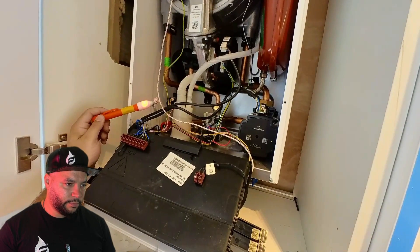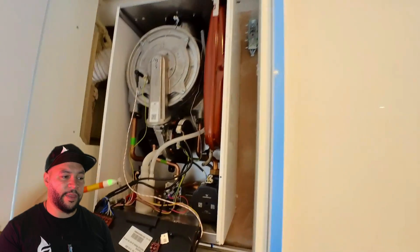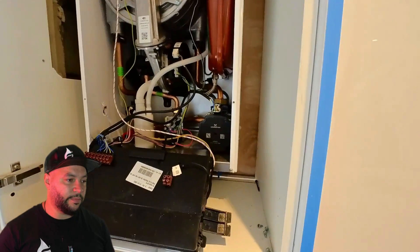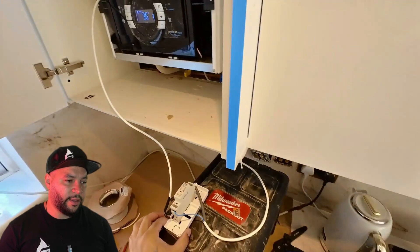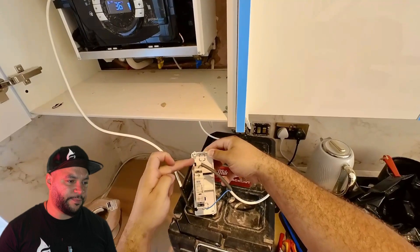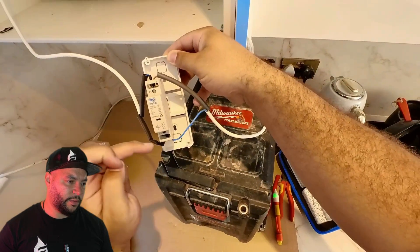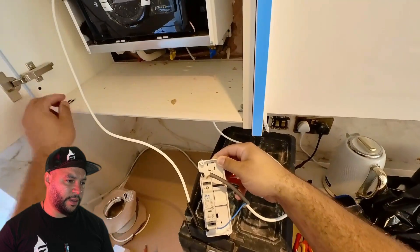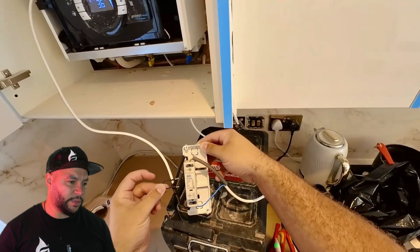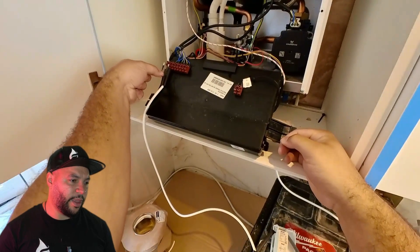So that's one cable. We can't put that high voltage switch live directly into the low voltage connection on the boiler — he's turned it off again, you can see it's gone off. This is where I've wired this contactor up. On the left-hand side you can see the low voltage link, and underneath is the connection for the boiler loop itself — and we've just replaced that for a two-core cable.